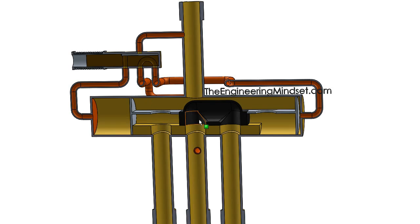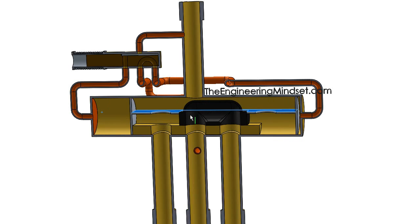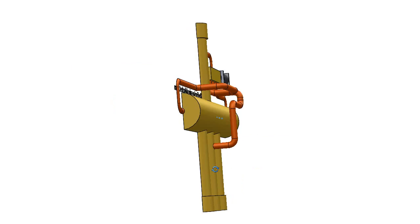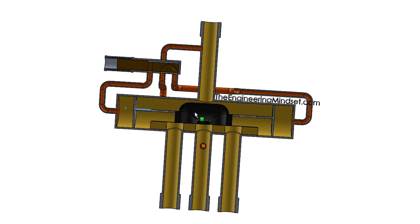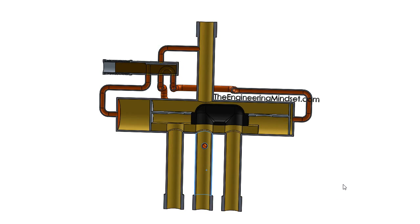The other capillary tubes just take the pressure away. As this valve moves across, there's going to be some refrigerant in there and the force of that needs to go somewhere, so it's going to push it back around into here. As it pushes this way, all that refrigerant that was in there would pass through this tube, back around through this tube and into the low pressure line.